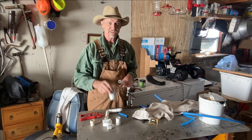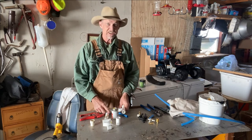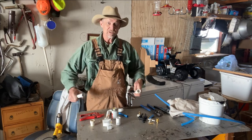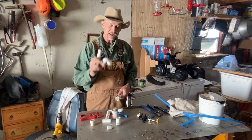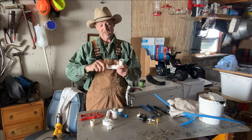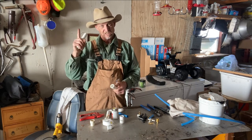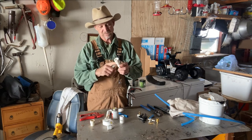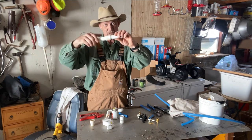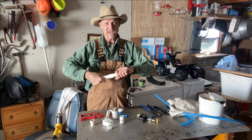So if all you got's glue, that's all you need. I'll attach a video above showing you how — I got a video of how you can make fittings if you get in a bind and you ain't got a fitting. Just like this is a sleeve. If I had a leak and I needed a sleeve but I ain't got one, look in the video above. Shows you how you can heat this pipe up and make a sleeve out of your pipe, just as good as them, especially if you're in a bind and can't get none.